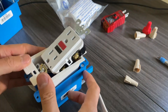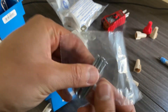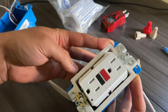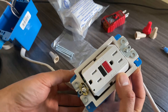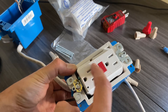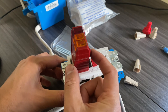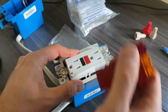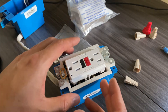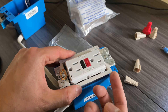Remove the existing screws because you'll need the longer screws that come with the sleeve, then tighten the outlet into the box. Once installed, turn the power on and press the reset button. Use a plug tester — plug it in, and it has a button to trip the circuit. Reset it, test it, and make sure the reset and test buttons work. That's how you install a GFCI outlet where you have six wires and three pairs — three black and three white.